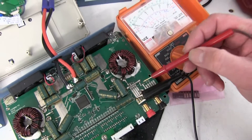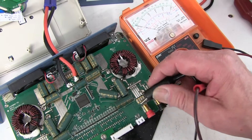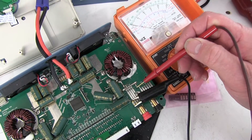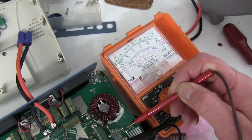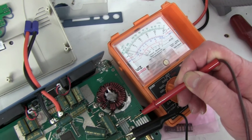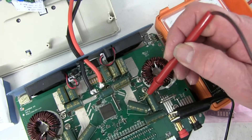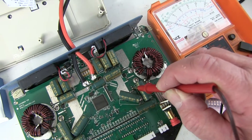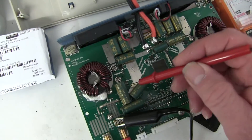They're normally symmetrically mounted, but sometimes they might be the other way around. I haven't replaced these fuses yet, so I've just got to get a connection on it. So: 100 on the first leg, middle not connected, and the outside one shows a little movement — it's slightly higher than the other side, which could be a worry. Continuing with the others: just over 100, middle nothing, nothing on the other side. You can check it on this side too — same capacitor, same FET.